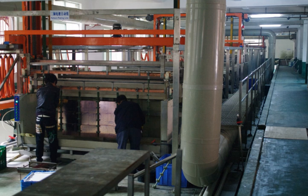The rate at which the anode is dissolved is equal to the rate at which the cathode is plated, and thus the ions in the electrolyte bath are continuously replenished by the anode. Other electroplating processes may use a non-consumable anode such as lead or carbon. In these techniques, ions of the metal to be plated must be periodically replenished in the bath as they are drawn out of the solution.